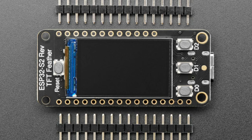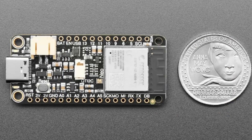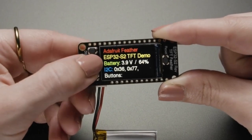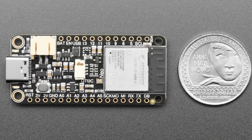You communicate with the display over SPI. There's a reset button and three I/O buttons; the D0 button also doubles as the bootloader button if you ever need to enter the bootloader manually. On the reverse side there's a USB-C port, another reset button, and battery charging. Something new: I've updated these Feathers from the LC709203 battery monitoring chip to the MAX17048, which is an ultra low power battery monitor that gives very good battery readings.